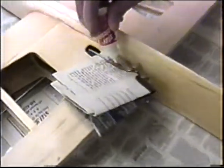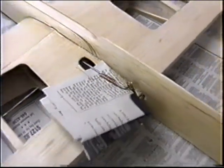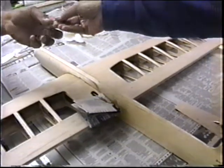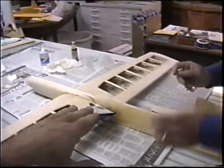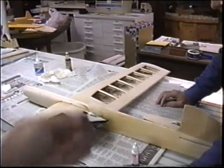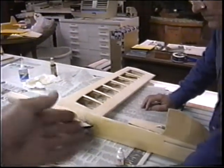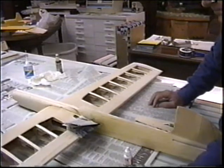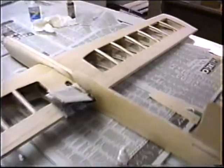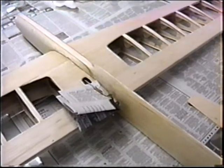The little adjustable joint so we can get a really true neutral. I want to be able, when I'm all done with that soldering joint, to heat it just a little bit and add a little down or up until I have the same amount up and down. The other choice, you could bend the push rod and slide it through and all that stuff, that'd be fine too. But if you miss, then this is the second choice. And this choice, you have the adjustment. I like having the adjustment.